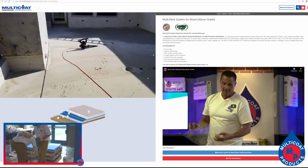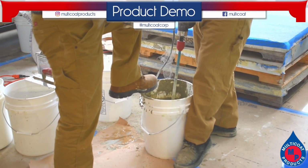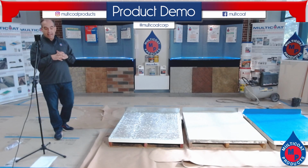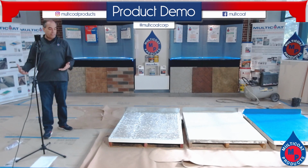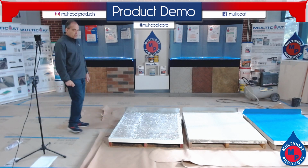So here on the boards that he's laying out, these first three boards, so you have the metal lath. For our above grade wood system, we specify 2.5 metal lath. We have you overlap it. We have you put staples every 1 inch in the overlap areas, every 3 inches in the field. As you can see on this board, we have like sample flashing.